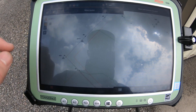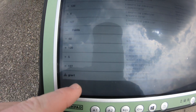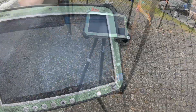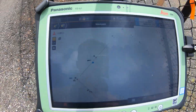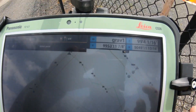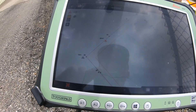Now that I'm locked on, I'm going to go to my first survey point — grav one — to tell the system where the Total Station is on site. I am now leveled up on our grav one point, so from here I'm going to click 'start' in the bottom right, then hit 'store' with the point selected. I heard an audible beep, and it says that point is now stored.